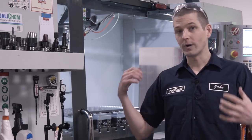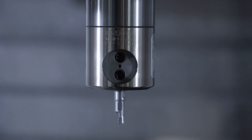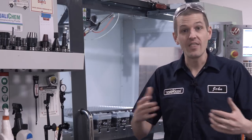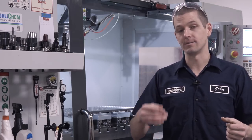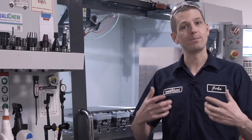From a hardware standpoint, one of the things I like about this Big Kaiser is I've got a thick boring tool — it's 10 millimeters, pretty close to the bore diameter that we're trying to make, and it's a short stick out. That means I've got the maximum stiffness. Here's the crazy thing: we still have tool deflection. It's not much — it's in the tenths — but I know it's there. So long as I can measure it, understand how that acts, and what it does in different materials based on the pre-bore diameter, we're good to go. But that's part of the recipe.